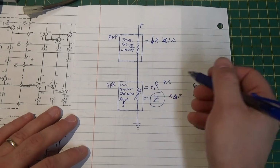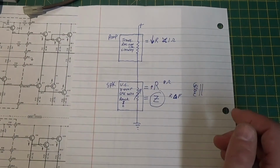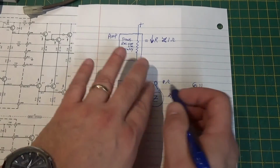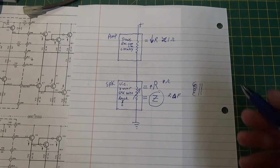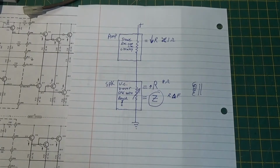So this can go up above 8 ohms, even higher. It can be 10, 15 ohms, and it can go lower too. It can drop down to 4 ohms or so, depending on what frequency. As you change frequency, and depending on our crossover and all these things involved, it can be all kinds of different resistances. However, for the most part, it's larger than this.